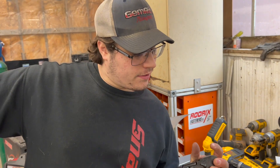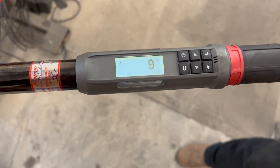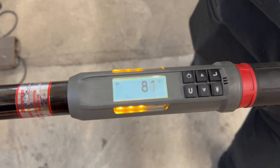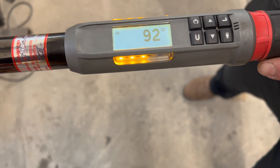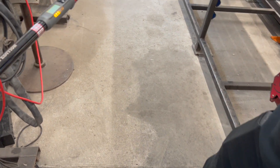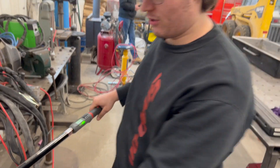We'll just start with 100 degrees. We'll put our socket on here. If you come over here on this side, you'll see — if you watch this — so it'll just tighten it. See? There you go. See how it's showing? It's starting to get tight. And once it gets to the setting that you want it at, it'll start going red, and then once it gets there — I'm moving the whole table now. I'm going to show you the degrees, and the whole torque wrench will vibrate. Let's try this again. There — you guys can't feel it, but the torque wrench vibrated.